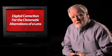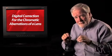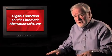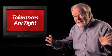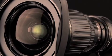As you probably know, some of the camera manufacturers have recently introduced digital correction for the chromatic aberrations of a lens. We lens manufacturers can get those aberrations down to a certain minimum level, beyond which it's extremely expensive to go any further. Tolerances are very tight, but on very wide-angle shots, particularly with a wide-angle lens like this, you would like that to be that much better.